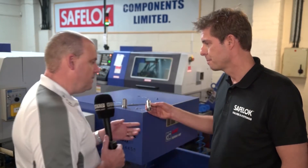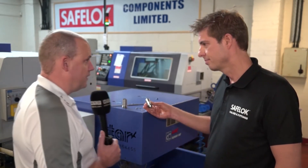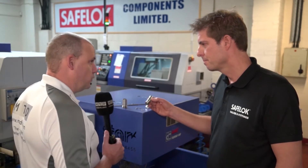Have you used Star's HFT software in order to try and crack that? Not at the moment, but it's something we're definitely looking to. Which one of your machines is actually producing this? We'd have to do that on our ECAS, which is a twin turret on the main spindle and then a platen on the sub-spindle. The ECAS has got enough tool stations to support all the features on this job and has better swarf control due to the ability to go from sliding head to a fixed head method with the turrets. Using HFT, we'd maybe be able to bring that part across to one of the newer machines — definitely yes, it's always a problem with stainless and mineral oil.